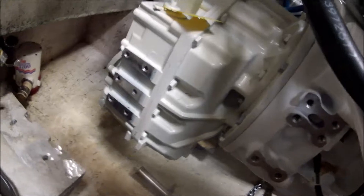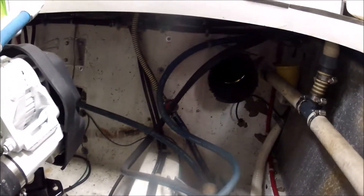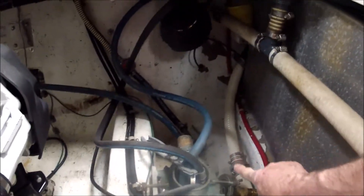We're just going to have to grind a little bit more clearances on these little notches for my mount. Once that's done, I'll start the next course of the project, which is taking out this — it has to move to the other side of the boat — and the water intake. There's also a water intake for the wash-down pump back there that has to all be moved to the other side. Then my exhaust will be here, with the outlet for the exhaust, and the drop muffler is going to have to go right here somewhere.